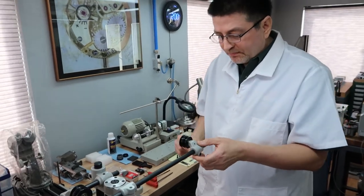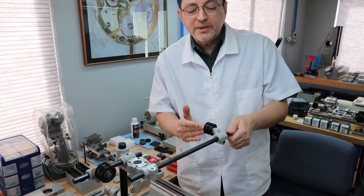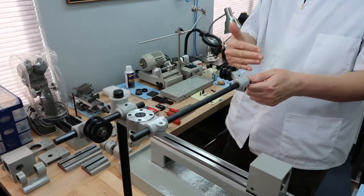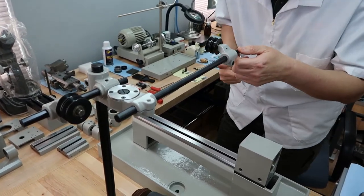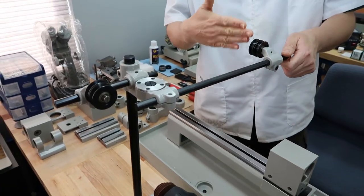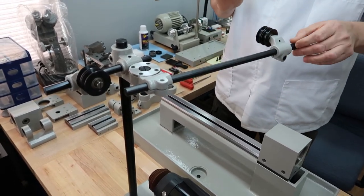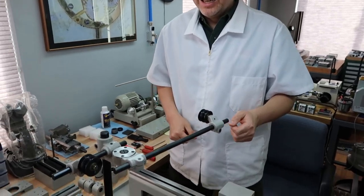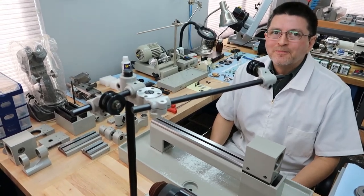We want to get the optimal placement of these pulleys — you want them right above the lathe bed. This isn't so critical that it can't be a little further away, but you don't want it way up here because you'd run into it with your head — or get hair stuck in the belt. So you really want it right above the bed, or maybe a little bit back, but not too far. Those are the three things. Once we start marking and drilling these tables, that's it.